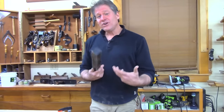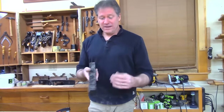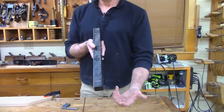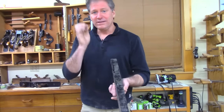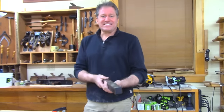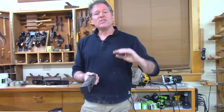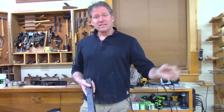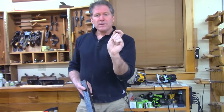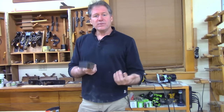When you're sawing $150-a-board-foot wood, you don't want to use a big fat table saw blade. If I ran this through my carbide-tipped table saw blade, like the Ridge Carbide or the Forrest, those all leave an eighth-inch kerf. If I make a few cuts, I've lost a hundred bucks. We're not going to do that — we're going to make these cuts more civilized. We're going to do it on the bandsaw, and I'm going to use the smaller bandsaw so that my kerf is small — actually a little less than a sixteenth.